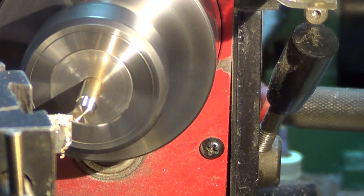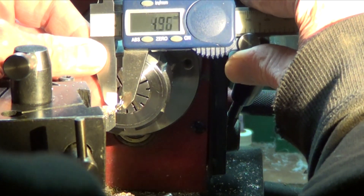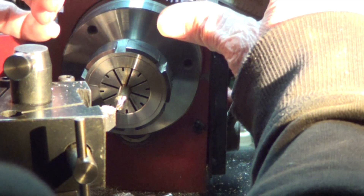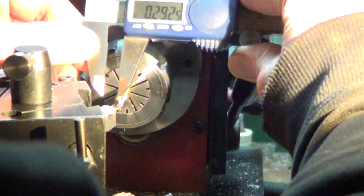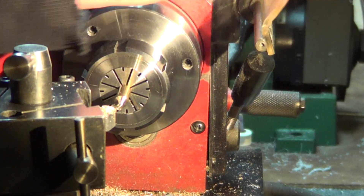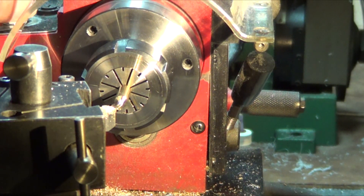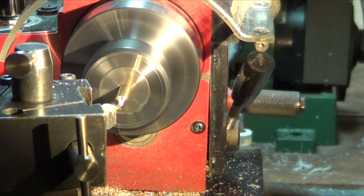This is just going back and forth real quick — almost at that. I've got to start checking it: three millimeters, I want to be around 118 thousandths. Looks like it was in millimeters — switch it over to inches and take a look at it. Got a ways to go, so start making some cuts deeper now, using the compound to keep the finish really nice.